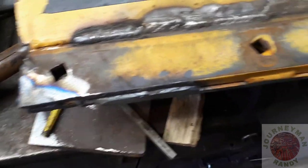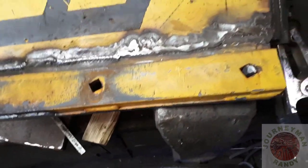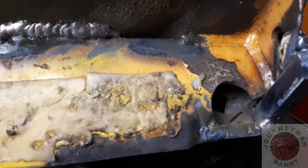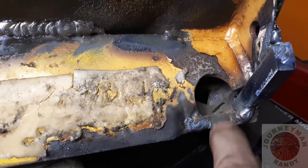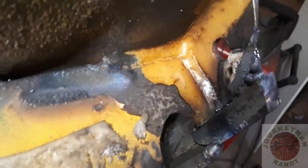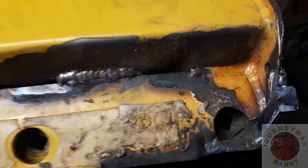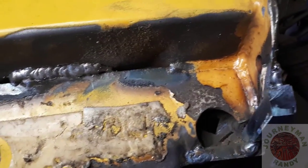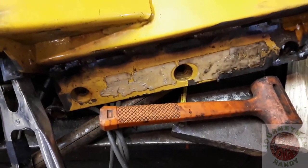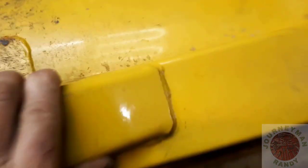The other end is pretty original — it's got a little bit worn off but not near as much as this side. We're coming near the end of the repair, and I think it's as good as new — usually it is when I'm done. Here's a better view of the back — there's the square piece down below, maybe three-eighths, and this is probably half inch. I'm gonna lay a little bead of weld up in that corner. You need a round hole like this to get the nut in there, so I couldn't come much closer. I'm pretty happy with that, it's turning out pretty good. It's another day and, you know, about two-thirds of the way through you start to think it probably would have been a better decision just to buy a new part, but here we are. I got one more crack — I'm gonna V that out and weld it.